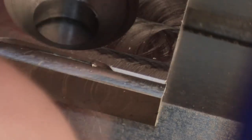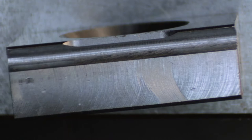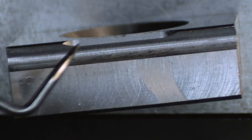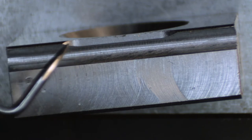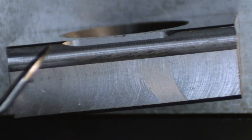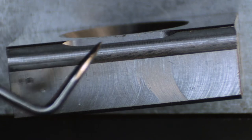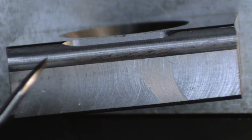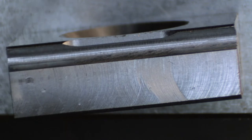Most of the rest of these look pretty good. Yeah, you can see that facet comes down, the relief between the teeth comes down to a point, even, and the edge just sort of disappears. If it were flat, you would see light on it like this surface and this surface, but you don't see anything because it just comes to an edge. And it looks to me like it comes down pretty much right the way we drew it.